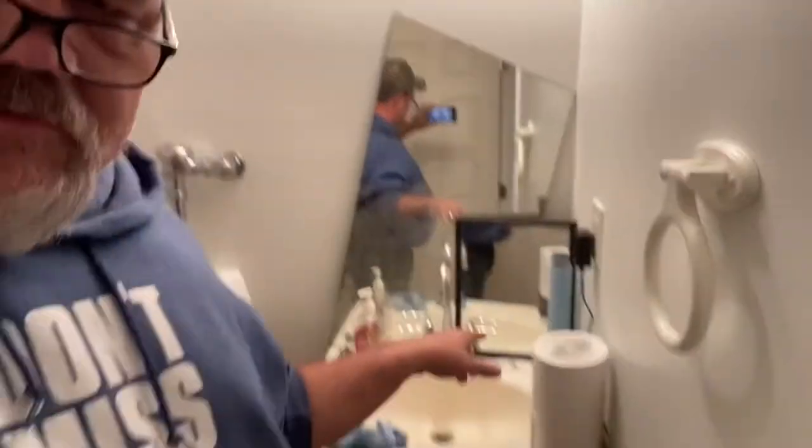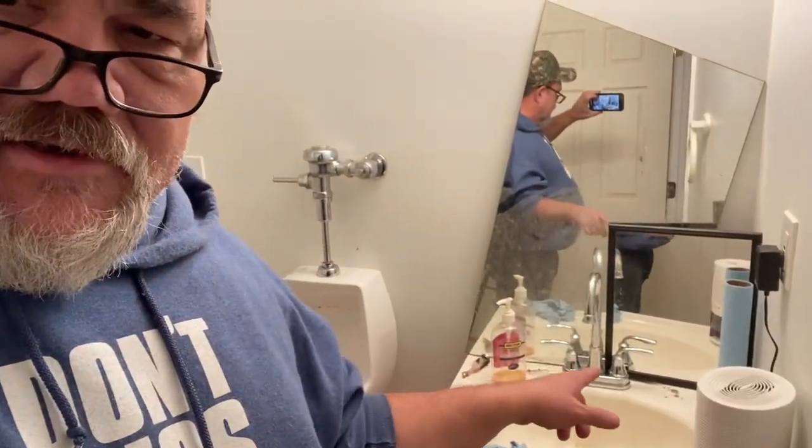All right, so that wasn't too bad — swapping out a faucet and I got it done in pretty much no time. I hope you enjoyed it and I hope it helps you out. You've got to make sure if you're replacing a faucet that the distance between the faucet handles is right — there are a couple of different sizes and if you get that off it's impossible. So make sure you get the right distance between the spigot and the handles and you should be good to go. Job well done. Don't forget, His way is the best way — we'll see you next time, God bless.